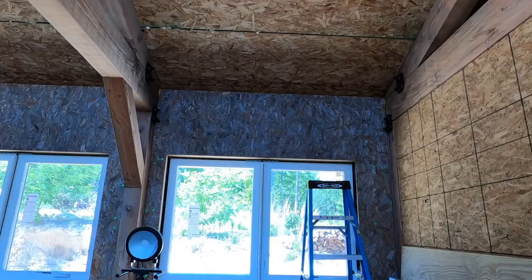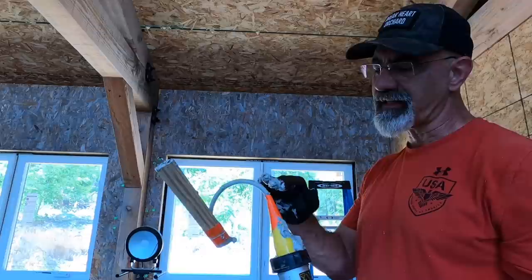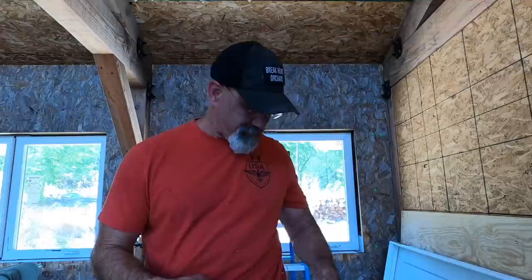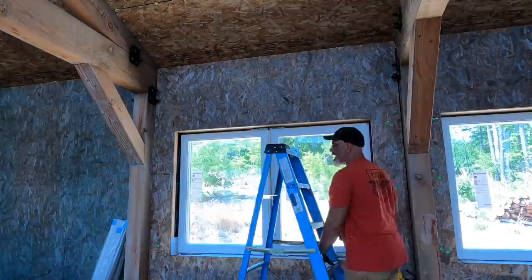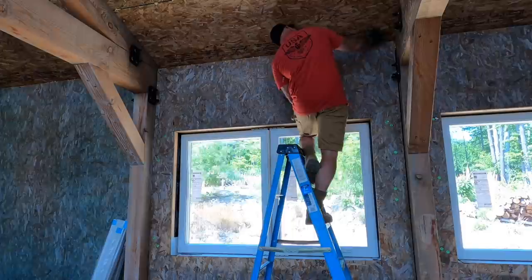So that's not working the way I thought it was going to — you can see a blowout up here, it's really struggling. I think the issue is it's just too constricted; the hole is just too small. I also got sealant on me, which is why I wore this old shirt today — this is why we can't have nice things. My eventual solution was to get in as deep as I could with the regular tip, put a bead of caulk along the top, cut a piece of wood to the angle of the roof, and use it as a trowel to push the caulk all the way to the back. It wasn't elegant and it wasted a lot of caulk, but it worked.